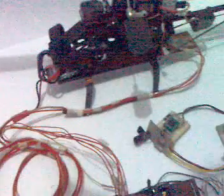That's the ESC right there, you can see, and this thing is the brushless motor. Power goes in from this pin here. These two connect, and this connection will give us power. This board we soldered just to distribute the power and also be a concentration point for our signal, because we have a signal wire, which is this one, which connects to the helicopter. If you want to control any of those servos, we just need to pass it through here and then via this cable. So that's what we have so far.